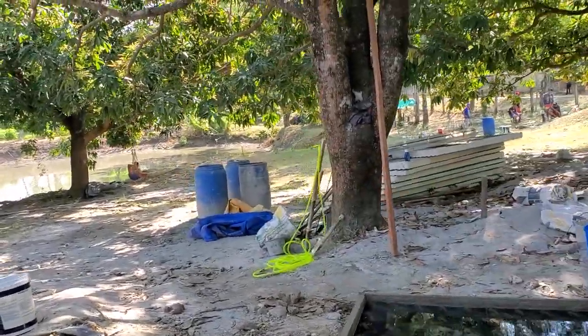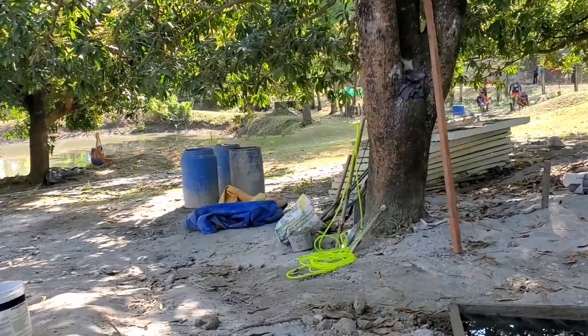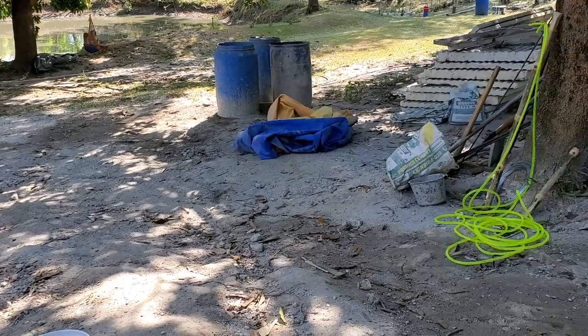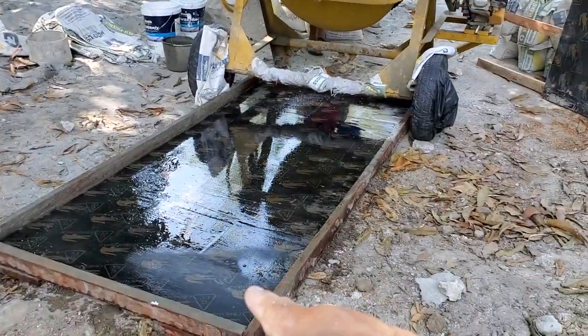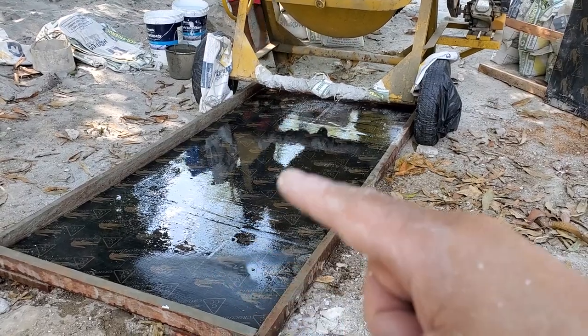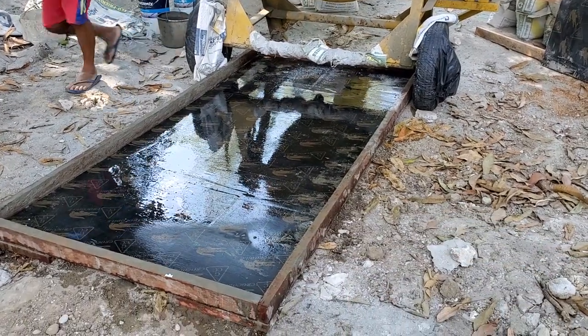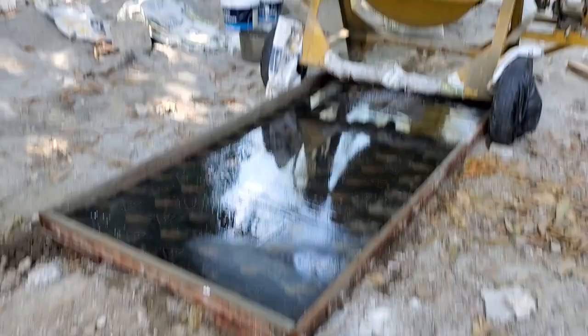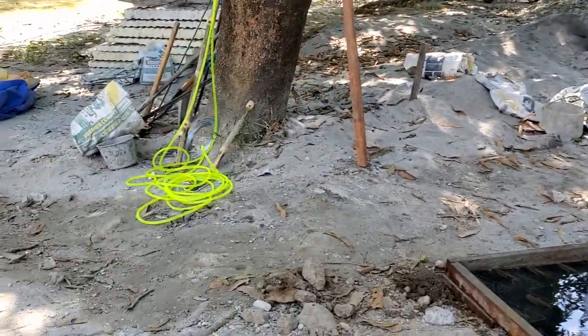If you don't want to ruin your land with all the cement slurry — like it was over here, and I'm still upset about that — what we did is we created this catch board here using the same phenolic half-inch. They pour it out, scoop it out, and carry it off. Very, very little mess. And these guys are just fantastic at keeping things clean.